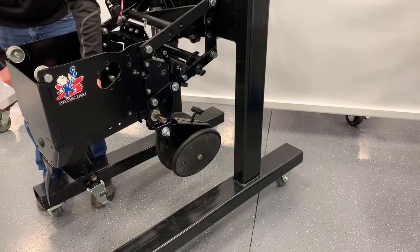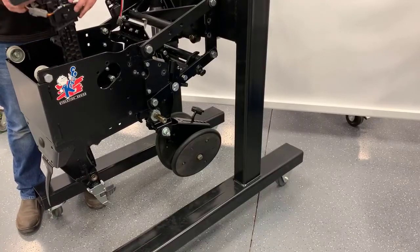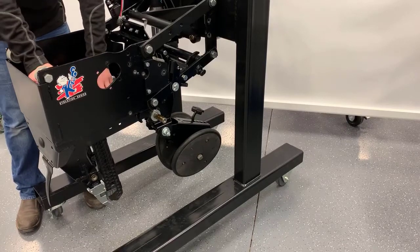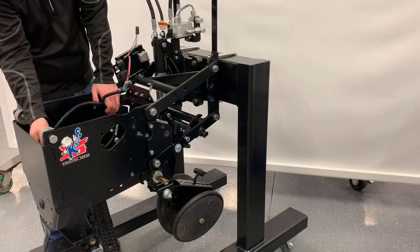The delivery rail should not be able to be removed once the pin is installed. Next, install the SureSpeed Delivery 2. Slide the delivery tube in from the top of the shank until it is resting on the delivery rail spring and is inside the seed tube guard wing. Connect the Rokan cable to the delivery tube motor at this time.